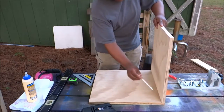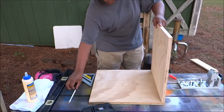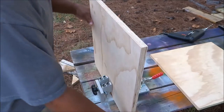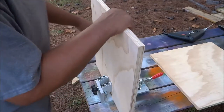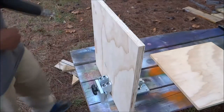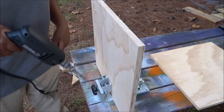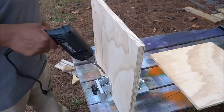So I'm going to do my pocket holes — one here, one here, and one here — and all my holes are going to be on the inside. I'm going to look down inside the hole to see where to line up my mark and get it right approximately in the middle of the hole. I'll set my clamp. I've already got my drill bit in and preset it and tested it to make sure it's exactly where I needed it to be. Now I'm going to make my holes.